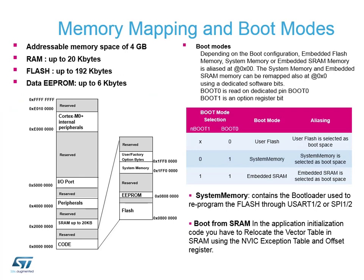The device still has the standard 4GB addressable memory space provided by ARM. Flash, EEPROM, SRAM, and peripherals are located at different addresses within that memory map. Boot modes are available: we can boot from main flash, or by enabling the BOOT0 pin we can jump into system memory where a bootloader for UART or SPI is included. If you want firmware upgrades, there's an inbuilt system bootloader, or you can run your own bootloader in main flash — the flexibility is there depending on your needs.